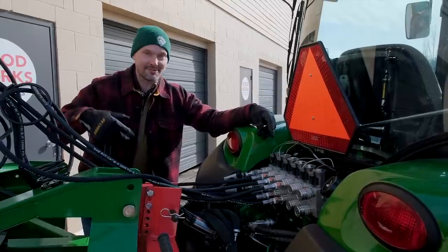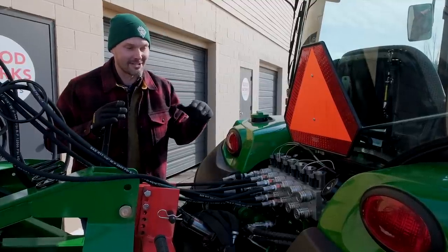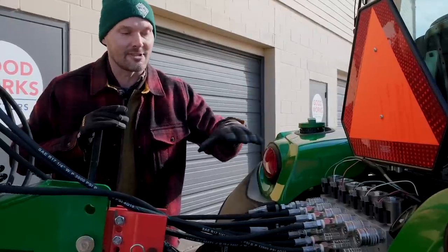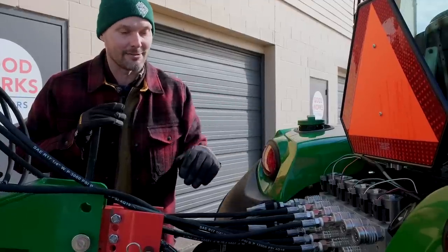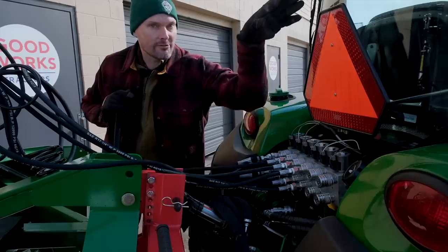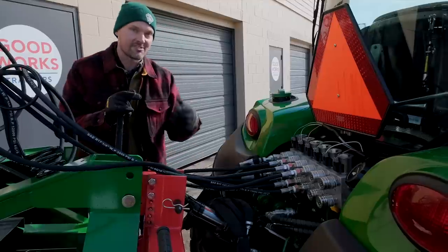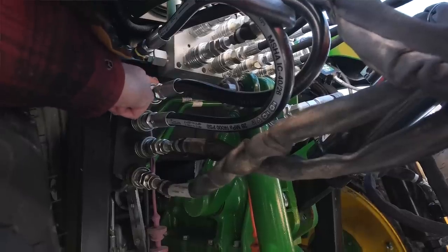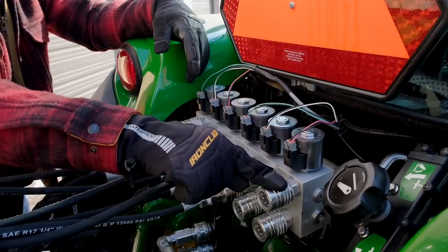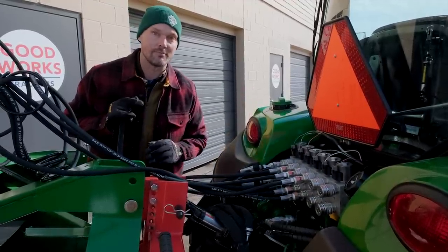Before we get to that, I need to explain what we have going on here — because if three functions just isn't enough for you, get yourself 10 functions like what I have right here. It might be a little bit overkill, but I want to go through it really quick because it gets kind of confusing and intimidating. We're not going to count the two functions up front for the front end loader. Besides that, there's eight additional hydraulic circuits we could have back here. Right here you're going to have your third function — these lines are actually plumbed up with soft hoses going all the way up front to run the grapple. Then a fourth function down here, and the fifth function is plugged into this hydraulic multiplier up top, which gives us six additional functions.